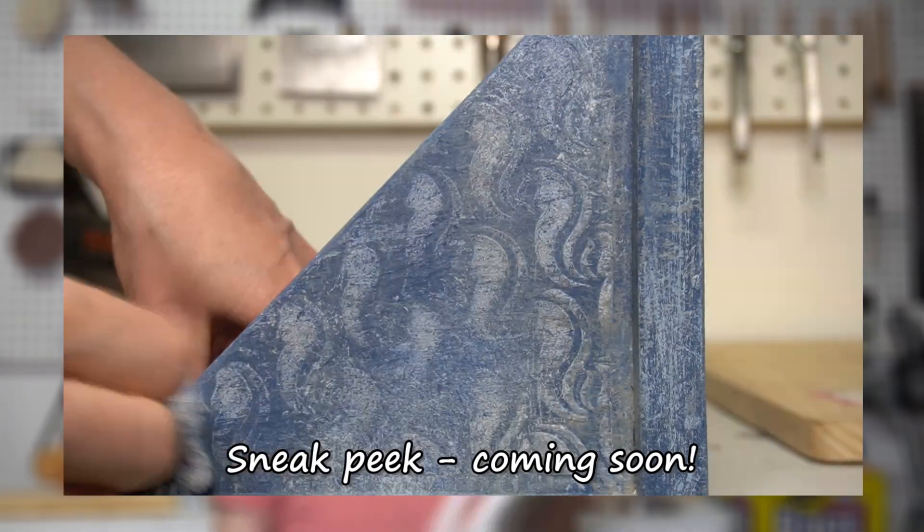I don't always use the grainers but they come in handy depending on the type of wood grain you're doing. For my glazing fans, another tool you'll want to have on hand is cheesecloth. Cheesecloth is really good for glazing, especially if you want old world effects with multi-layered plaster type finishes — it gets down into those areas and distributes glaze very evenly. In a pinch you can also use cheesecloth to buff out wax. Highly recommended as a cool tool to have on hand.